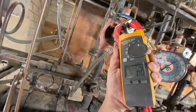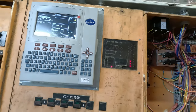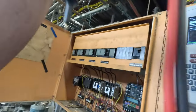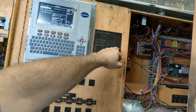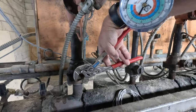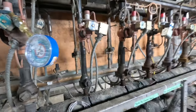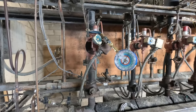It just opened up. Now we have the arbitrary number - we're pulling down nice and quick. Our liquid level came up, which is awesome - we're up to 30% right there. Usually we shoot for 10% to 20% area - we leave it low on purpose, just enough to make the system work. If you have a leak, you want it to start failing out right away so you're not wasting a lot of refrigerant. That's why we don't fill the receivers up full. Still right around 13 pounds - let's go ahead and close this suction line and see if that thing jumps up. If it jumps up, we know we've got a lot of refrigerant in there yet. It's not jumping up. What you could do is use your recovery machine to pump it out into the suction line of one of the units beside it to check that without losing any refrigerant or violating any EPA laws.